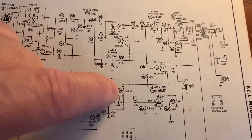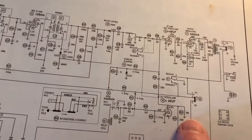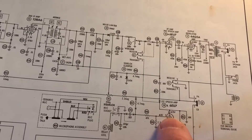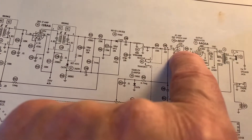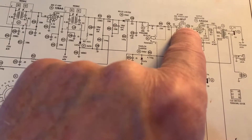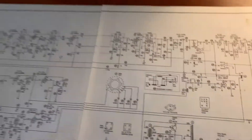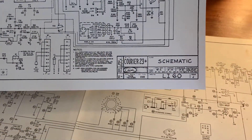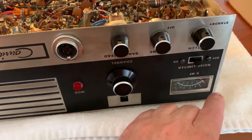I'm not sure exactly what this 4.7 meg is doing, but the 6EU7 tube is the issue. When I power this thing up I'm going to put a voltmeter on it and see exactly what the grid voltage is — both grids on that tube. If they're a little bit negative, that means the audio circuit can't deliver a lot of grid drive. The only thing you can find online is the schematic for the Courier 23 Plus. I know for a fact this is the original 1965 ECI Courier. Then Phantom took them over and updated the display and the meter.